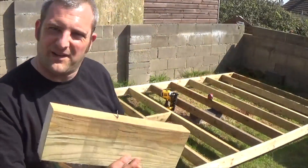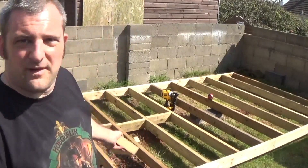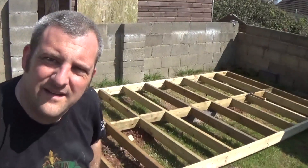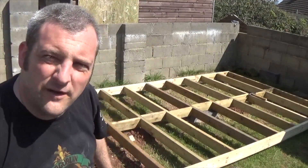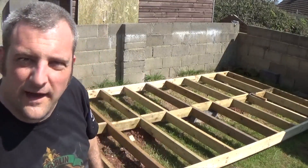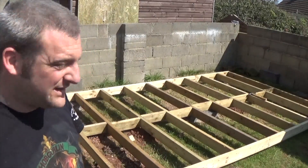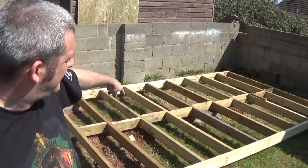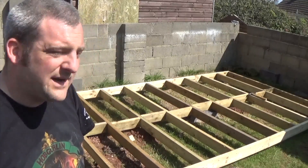There you go — that's all the middle done. Just in case I didn't mention it, the reason why it's staggered is so I can get my nail gun in there. Even if you're hammering nails by hand you still need a bit of space to whack them in — that's the reason I staggered them rather than doing a straight line all the way through. Looks alright. Just a little bit of mismeasurement. Next thing to do is go around with the drill, countersink and screws, put a screw in every joint for a little bit of extra strength — all galvanised screws so they won't rust — and then it'll be floor time.